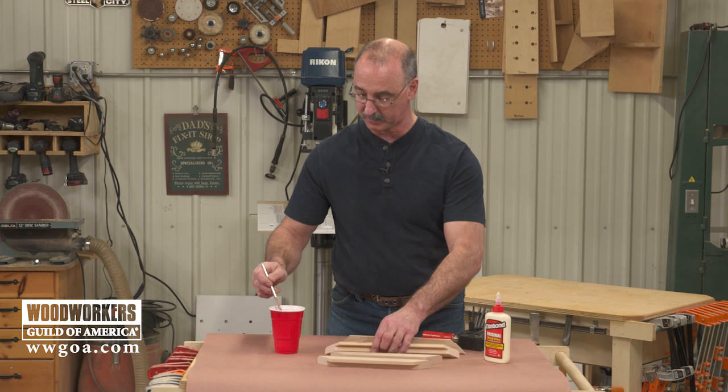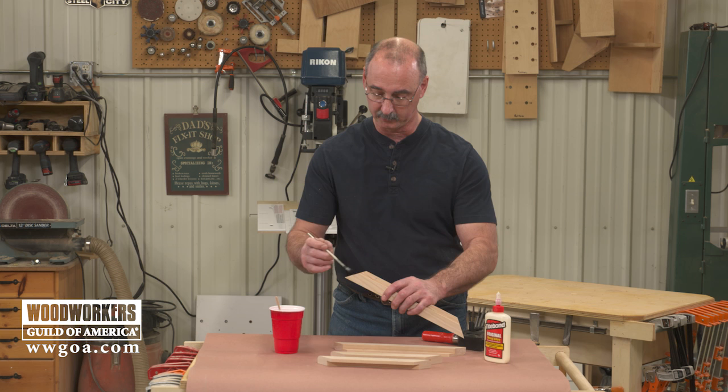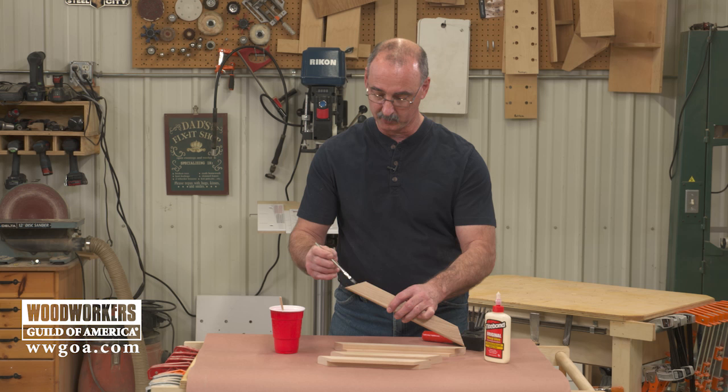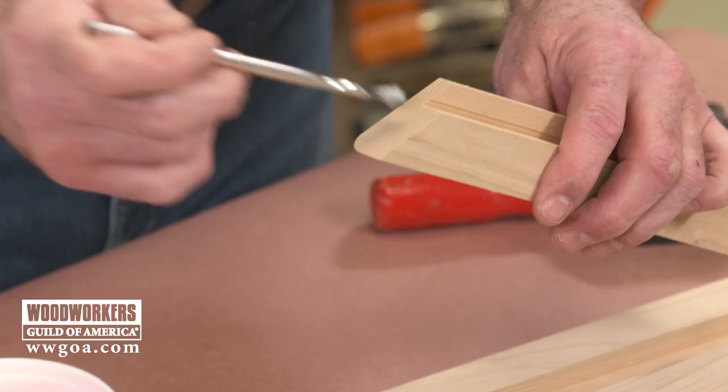It's really important when you're using this that you remember to dilute the glue. If we just let that build up there in its standard viscosity, the glue itself is going to be way too thick and it's going to be really impossible to get the joint to go together. So I'm going to keep giving my miters the brush off here, then we'll come back and do an assembly.